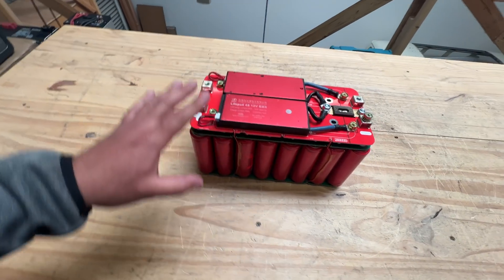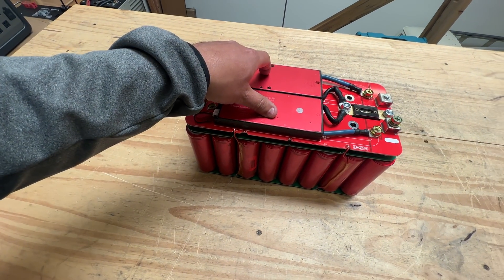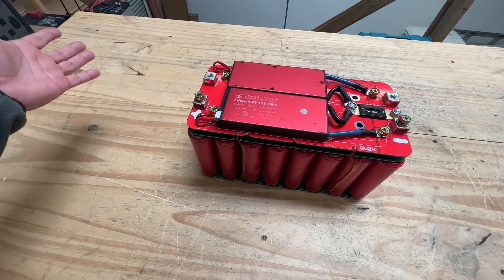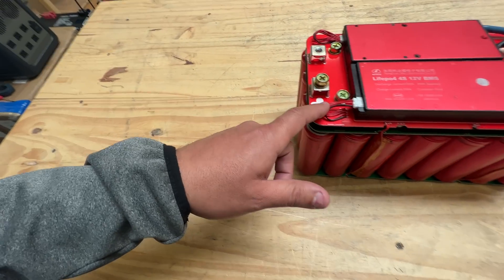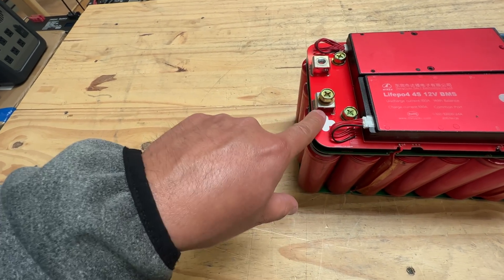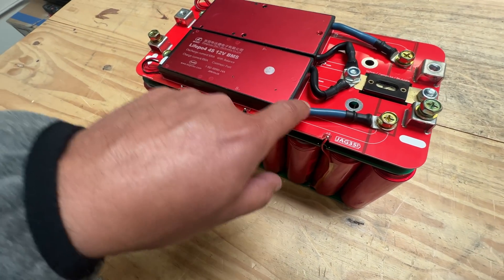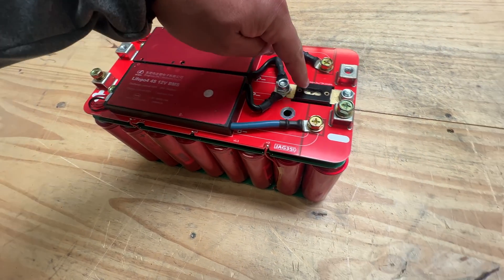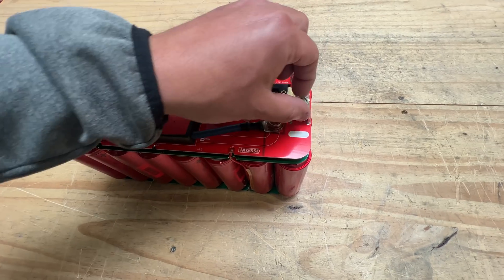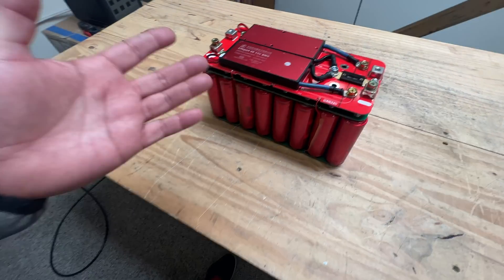I was going to show you a load test on this — these are 100 amp cells so 200 amps — but we've already done the load test on these PCBs at 500 amps. The pathways are very short: here's the negative into this board, the positive into it, and the positive out — less than an inch going in there. The negative from the battery runs through this cable, exits right here, dumps into the fuse, and then from the fuse it's less than an inch to the actual terminals. So the pathways are very short. 200 amps, no problem.